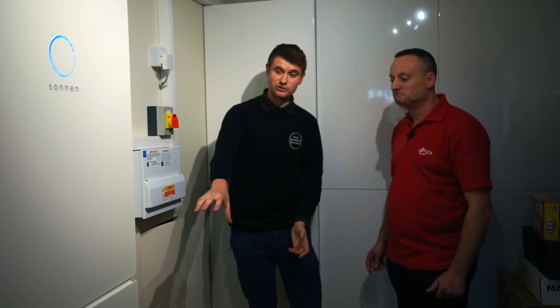So take the example where we had a thousand watts of solar and 500 watts consumption — say the solar is still producing a thousand watts but the house is now needing 1500 watts. The solar isn't sending any power back to the grid, it's sending all of its power into the house taking up 1000 watts. So now there's 500 watts still needed in the house. Instead of buying that in, the battery goes: right, I need to discharge that power into the house to stop the customer buying any power. The power comes from the batteries through the inverter and feeds that 500 watts into the house. There are small losses with anything that has transformers, but they are small. These Sonnen batteries are in my opinion one of the best out there.